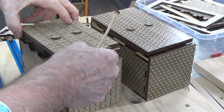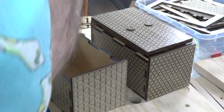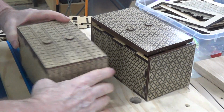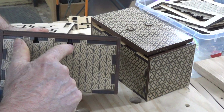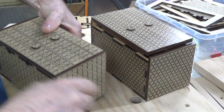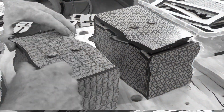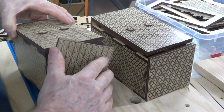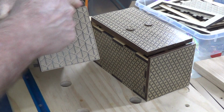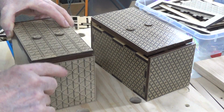That's how it is. Now actually the way when the box is assembled, or actually should put it together the right way, the sides and the back differ only because naturally the back has to allow for the slots for these pins to come out of, like that. Now to actually permit, as you can see the sides come all the way up, to permit the slides to move, you have to rotate the side. Now you'll find that the pivot for the rotation is off center, so now it exposes these layers. There's actually 3 layers of 3mm MDF there, which I'll go into in a second.